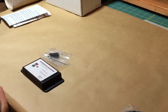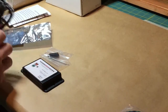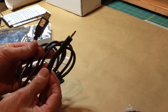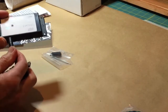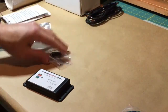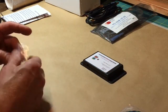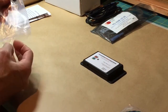The serial cable has a USB connector for a computer on one end and a phone plug for the EVCC on the other. You'll see it plug into the EVCC here just for example. The little bag has a CAN termination resistor for systems without a BMS, and a wire connector and a wire release tool.